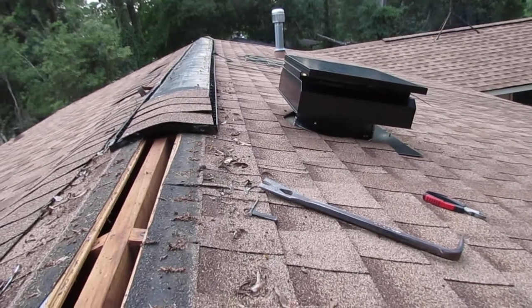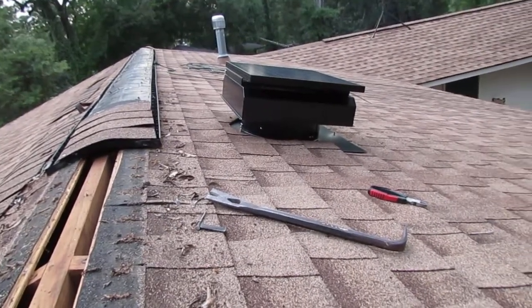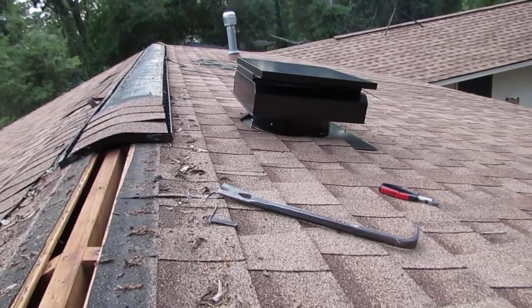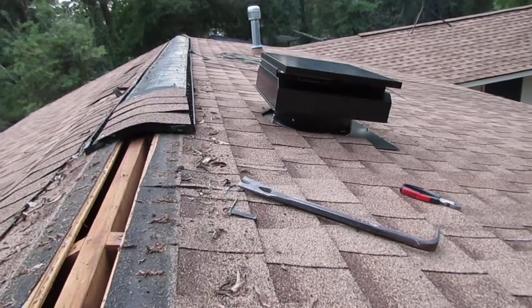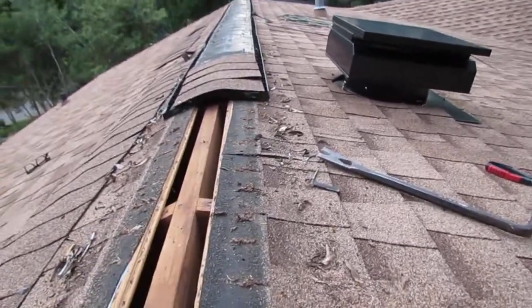Not only that, it needs to be ventilated in the wintertime as well. In the wintertime, this thing runs at slow speed in order to keep humidity out of the attic, and that will hopefully prevent mold from forming on the wood structure below. I hope this has been informative, guys — thanks for watching.